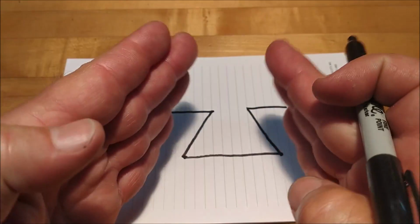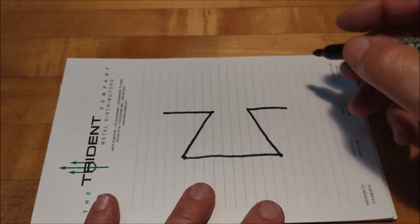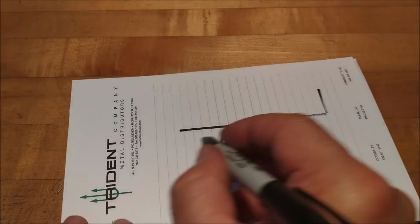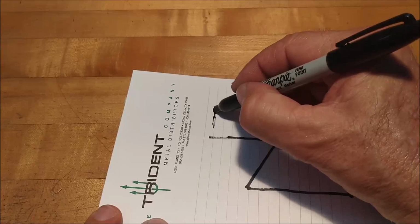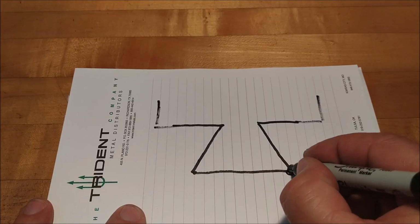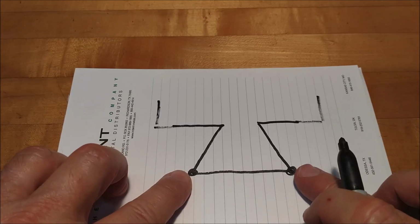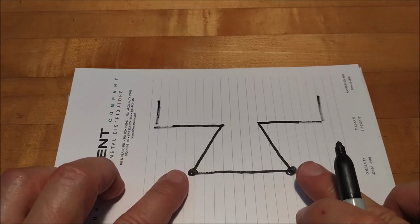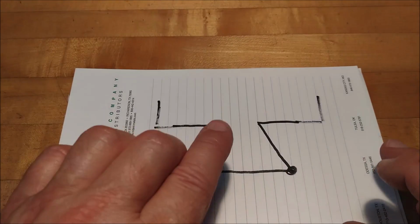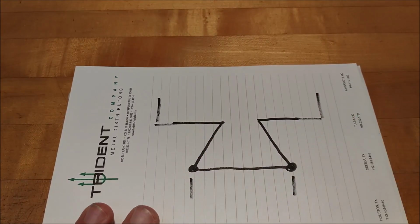You're going to get an angle of the dovetail, and you're going to get a dimension somewhere. Top, bottom, something somewhere. Let's say this is a positive feature here, okay? So this is something that you can hook your fingernails onto. This is not a negative female dovetail. This is a positive. The dovetail that I just did was dimensioned here. It was called out as a 500 theoretical, because very rarely are you going to cut a dovetail to a dead sharp corner. On mine, the model I just did, I had to remove those corners. So in reality, the only way you could check that is with pins or a comparator. So there's dimension number one. That's incredibly valuable right there.